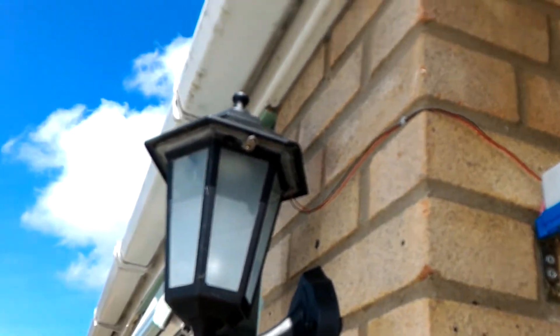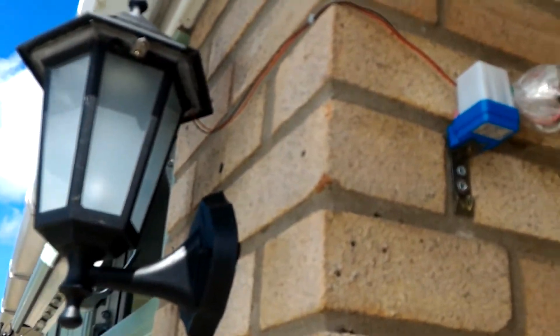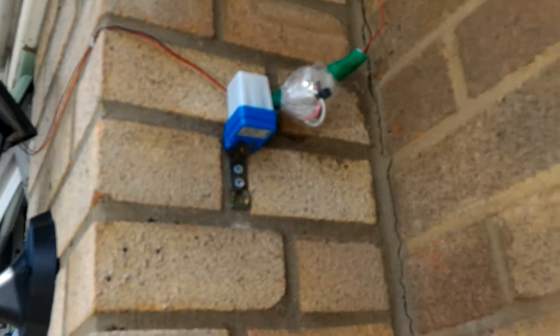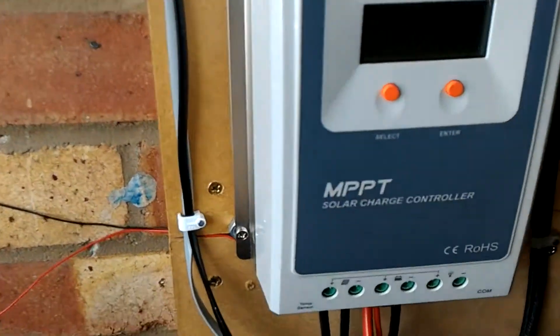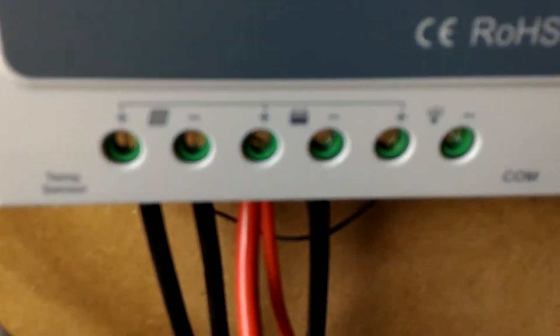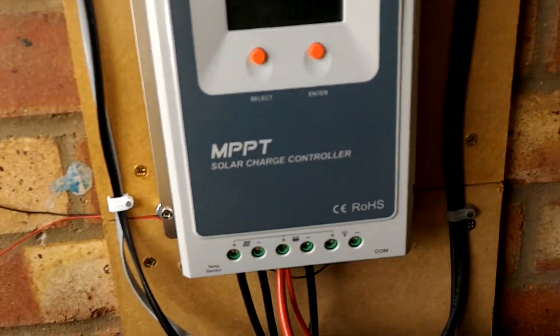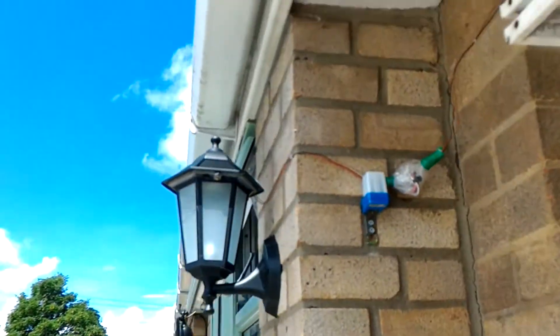It's also operating my little auto lamp. This is an old solar lamp which I converted — I put a 24-volt lorry DC light in and wired it with an auto switcher so at night time it kicks in. It operates automatically so I don't even have to think about it; it just comes on and goes off at night.